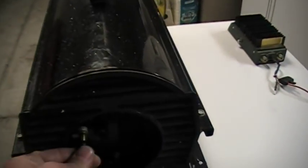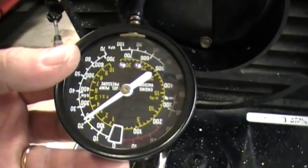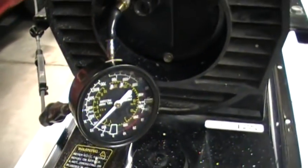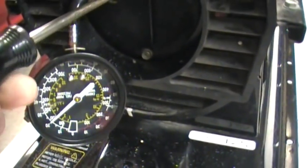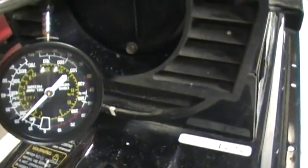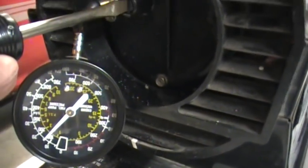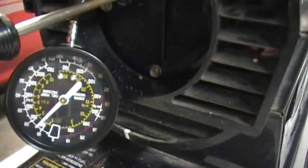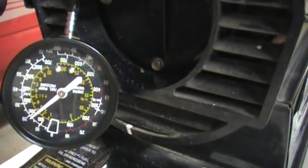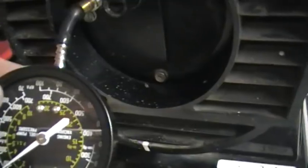It's as simple as this. I've got mine running right at 3 PSI. Once you adjust it, put your screwdriver in there and turn it. Turn it counterclockwise and the pump pressure will go down — I'm at 2 PSI now. If you lower it, it's not going to be as red in the front, not as much heat. Turn it clockwise and you'll increase the pump pressure. We'll get it right at about 3 PSI — that's where she's supposed to be.